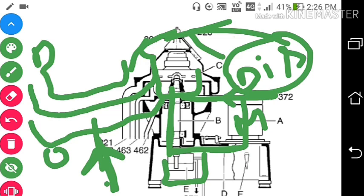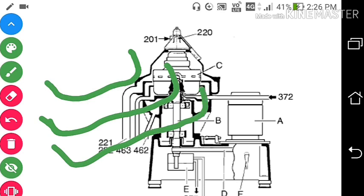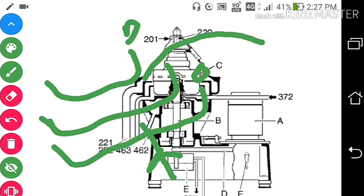I will explain how a sludge operation takes place. In order to open the bowl, we give opening water to the operating slide. Water is given to the operating slide, and simultaneously the water in the discharge slide drains off. This is the opening of the bowl — water supplied to the operating slide, and water drained through the discharge slide.